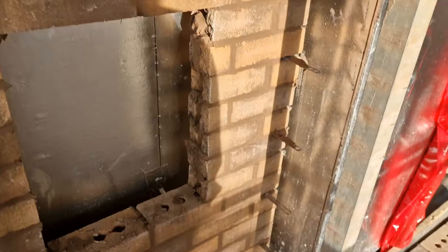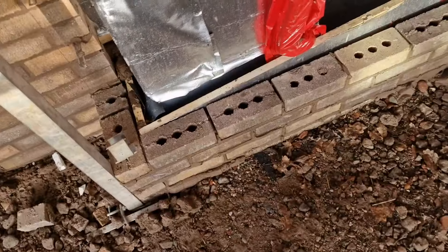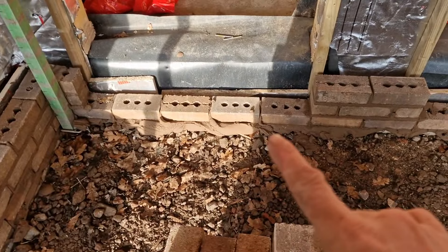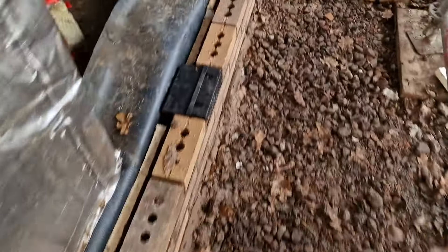Yesterday we managed to get the brickwork up on a panel but it was going dark so I didn't get any more footage. I'll turn you around — we've got a meter box here, round to a movement joint, and we did this little panel here. Today we're going along setting all of the splash course with the vents, getting that across this morning. We've done down this section, done in here — inside these doorways has got a curb stone to go in, so we've left them down.